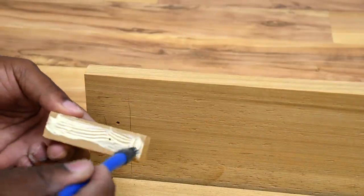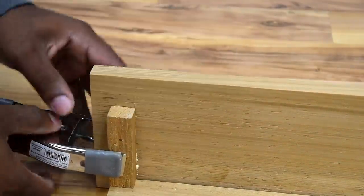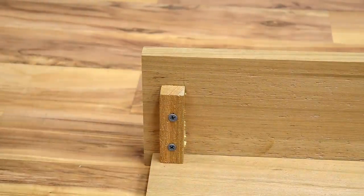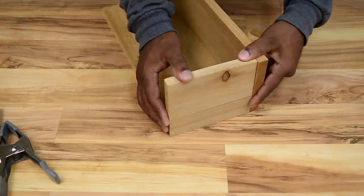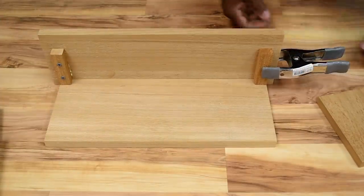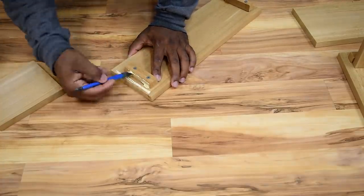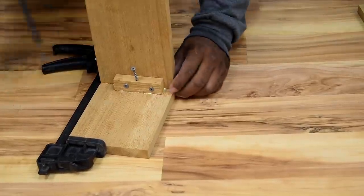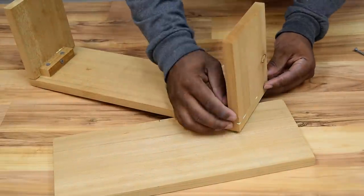After pre-drilling and marking, I'm using wood glue to help strengthen the corners. Clamp it back into place and then install a few screws. Place the block inside the pencil marks — you could add wood glue first to skip a step, but I wanted to make sure the wood didn't shift. Follow the same steps for all four corners. On the outside of the corner blocks, add a generous amount of wood glue on both pieces — cedar tends to suck up the glue, so apply as much as needed. When done correctly, everything should slide into place and line up.